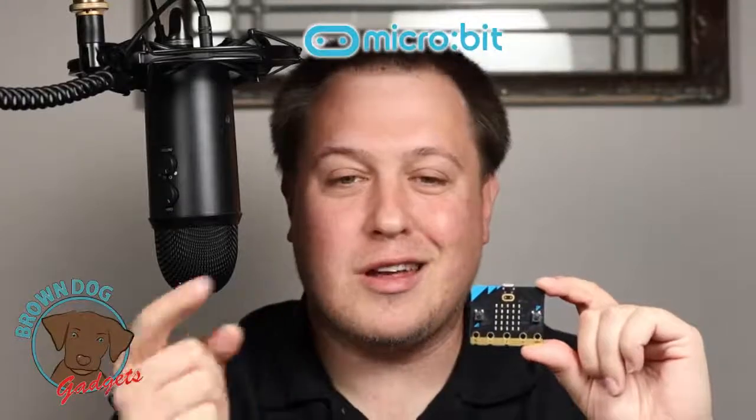And it also has another cool feature, built-in capacitive touch, because they upgraded the processor on here, so now it has capacitive touch capability. What is capacitive touch, you're asking? It's the thing that makes all your cell phones and other touch devices work. Essentially, you have a bunch of different data points on a screen, like an iPad or phone screen, and it says, hey, when I turn on, I have this much capacitance, this much electrical energy at this point. Now, when your body touches the point, we add a lot more electrical energy to it. A higher amount of capacitance can be held because our body is mostly water. So it sees a state of change saying, hey, I'm being touched. It's really a fancy way to press a button without really pressing a button. It's on all of our devices.